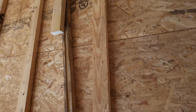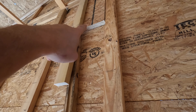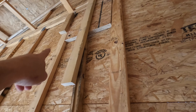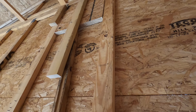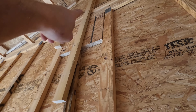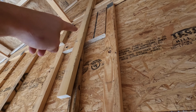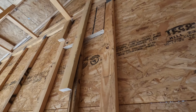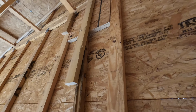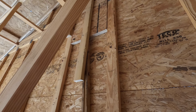I had to get a little creative on how to mark my hole on my mounting block. I've got two pieces of three-quarter inch OSB screwed together, with my hole marked on the outside. I just wedged this in between the truss members — that way it'll set my fan out away from the exterior just a little bit. This brace here will get cut off, but I can get a good seal on a flat surface and have something solid to mount to. So I stuck it up in there with a stick, screwed it in place to hold while I marked my line, then unscrewed it and dropped it down to go cut the hole.